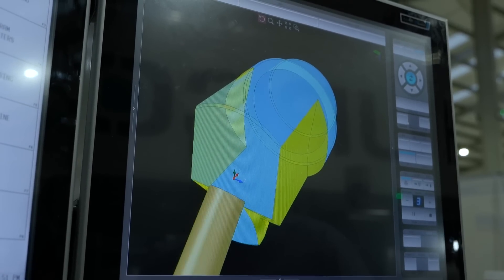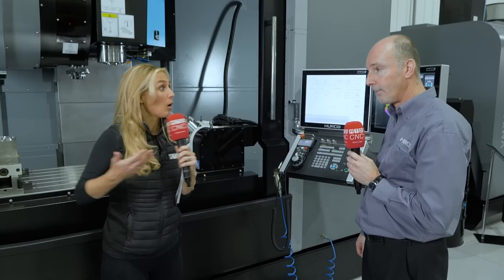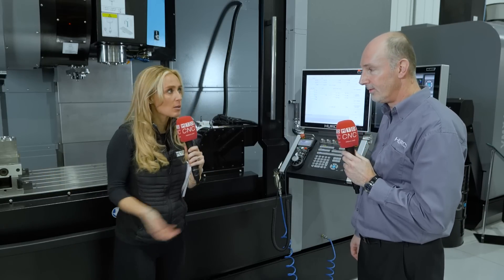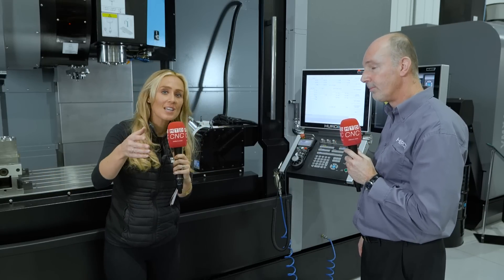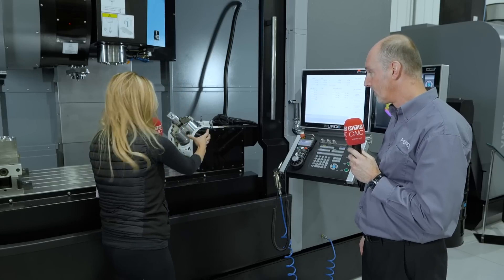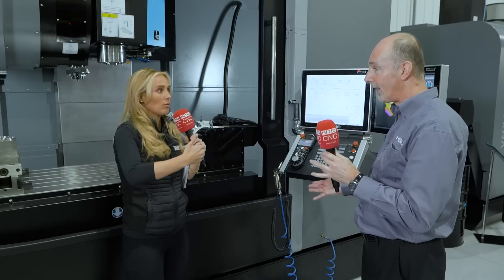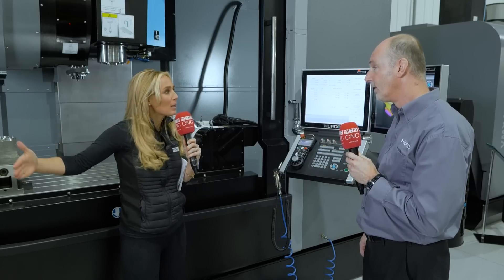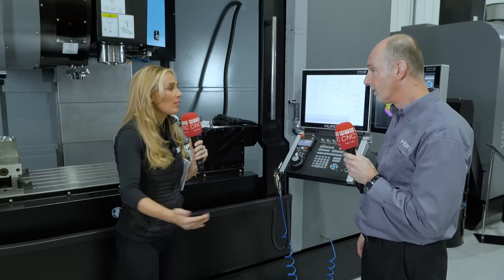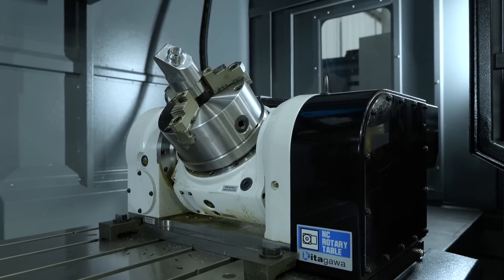What's so brilliant here is — let's admit, if you're going for a full five-axis machine, you are investing considerably a lot of money. The table size could be a 500 table. Whereas actually, you've got the best of both worlds. Because if you're investing in this rotary table, you can pull it off and use your full table. It's a three-axis with a huge table for another job, and then you've got five-axis capability. People take them on and off weekly.